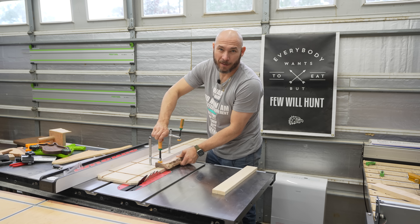We have our jig. Now we can joint boards, taper boards for tapered legs, and use it as a high fence. The way jointing works is you lay the board you want to joint on there, slide on your micro jig dovetail clamps, lay the board on top, and clamp it down — super simple. I can joint boards probably up to six feet with the four-footer. Once everything's clamped down, you put the square edge against your blade and the chamfered edge goes against the fence.